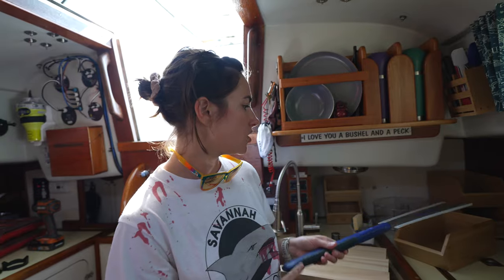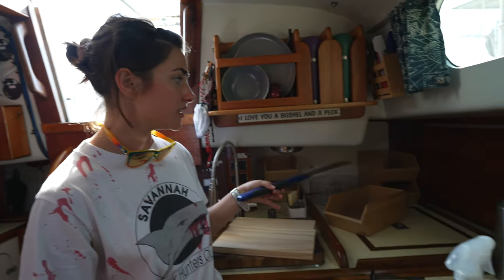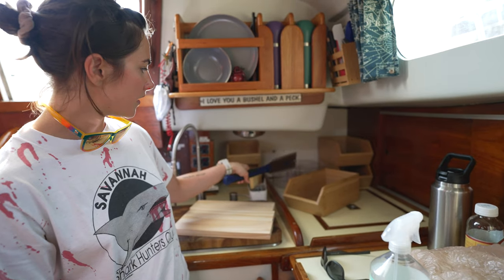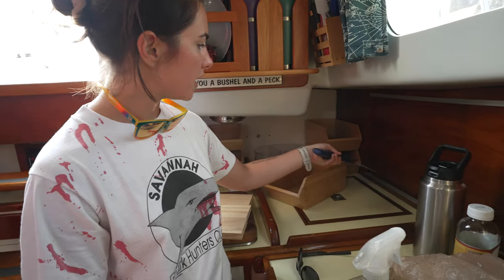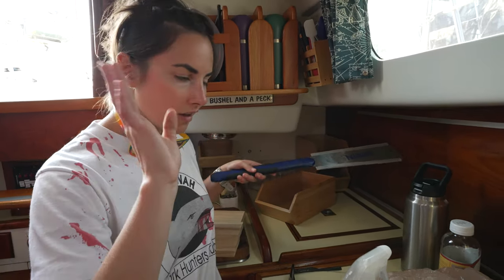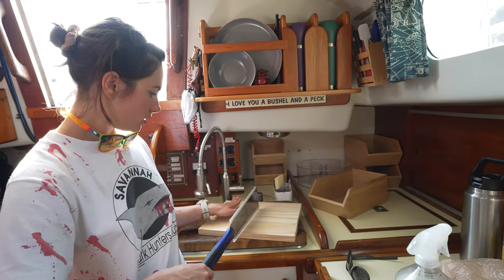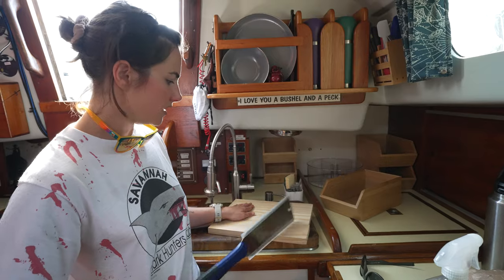And so we found these shelves at the Container Store. They're bamboo, and they're perfect because they're stackable, so we can use all of this space here. We have small ones. We have this clear, rotating shelf. Also, with the front covering here, things hopefully won't slide out, especially because they're facing forward. So I'm cutting these to put shims behind the shelves. And then we'll screw these into the wall, and then we'll screw the shelves into these.